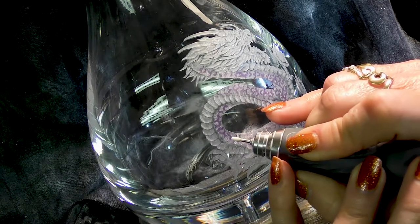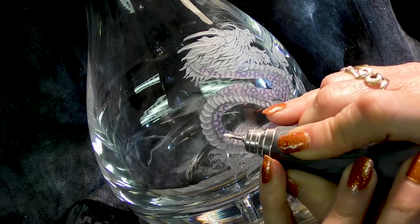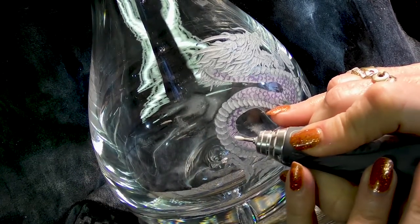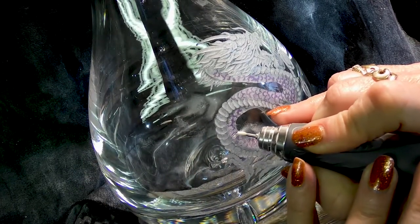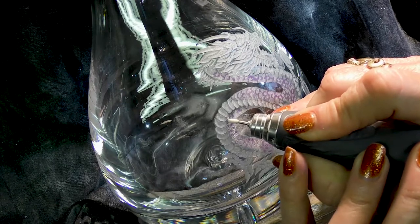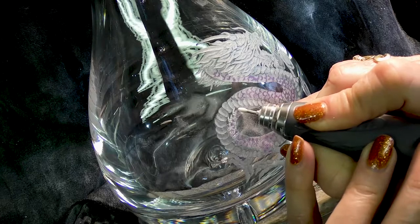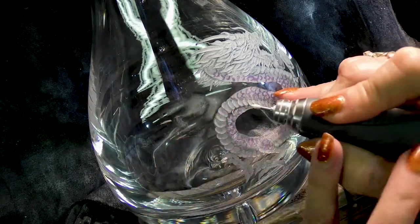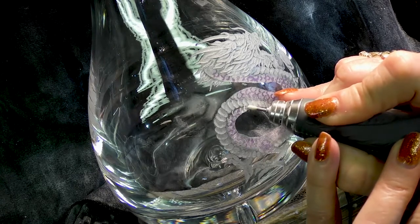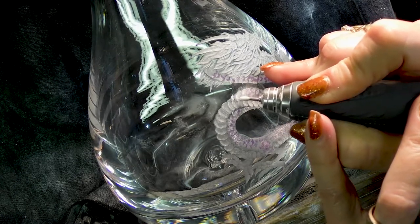It's an amazing effect — it sort of crackles and creates these tiny little shards, so you have to get rid of that. I had a tiny green stone which was a little bit rough and it was enough. Otherwise I would have actually taken a diamond and gone over it just to smooth it out, because you've got to get rid of these little burnt shards. So just remember — white Arkansas does not need to go fast.